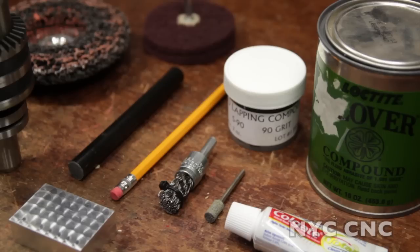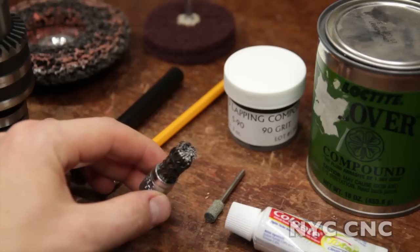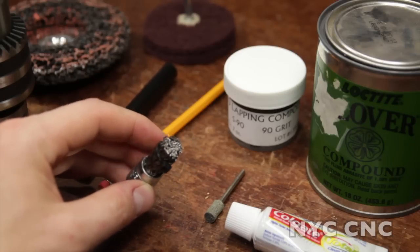If you're jeweling a really hard material or you want to make a really deep scrape, use a tool like this. It has thick wire brushes. I use a zip tie to keep the wires from fraying out so that the tool holds its circular pattern.